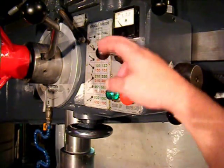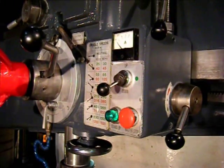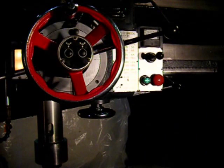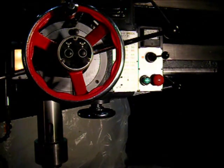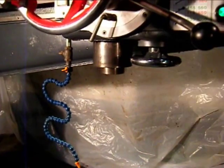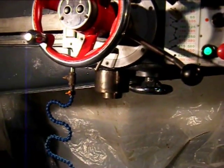Bringing the lever into the down position again unclamps the column and lowers the arm. The same joystick is used to engage the spindle. Here we're showing the drill at 1500 RPM, which is the max RPM.